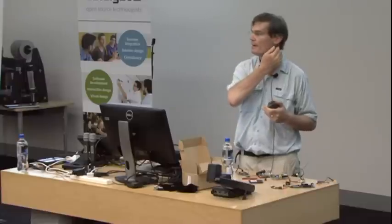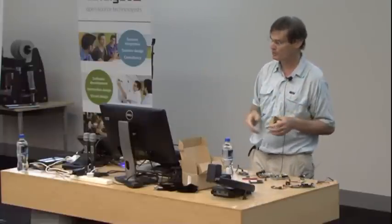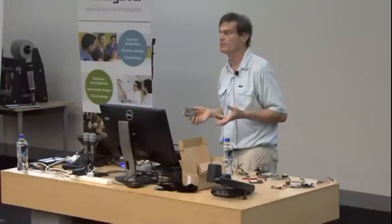So you attach your receiver, any of the types of receivers, to this one pin, and the 200 megahertz PRU is just polling that pin, producing a pulse train, and it calls a function called process RC pulse, which puts it into three parallel decoders, bit-banged serial parallel decoders. Whichever one says I'm valid, the checksums are sensible, the number of channels is sensible, that's the one it is. And for that frame, you decode it that way.